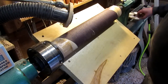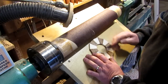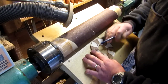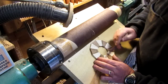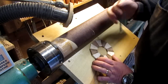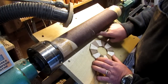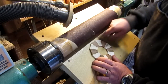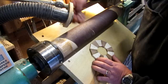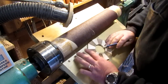And this sander, I've had a lot of questions about this sander. I've got a video on how I built it. Just make sure you don't get your hands in the front part here, because this thing's spinning this way and it's trying to pull or push things this direction. You can come in from the backside all you want to. It just kicks your hand out. If you accidentally contact it, it can't pull you in.